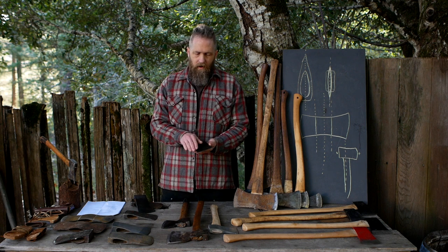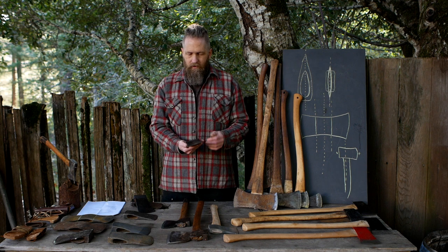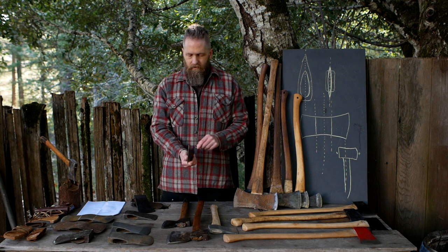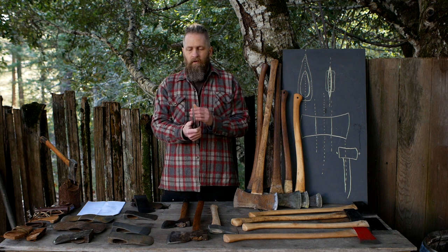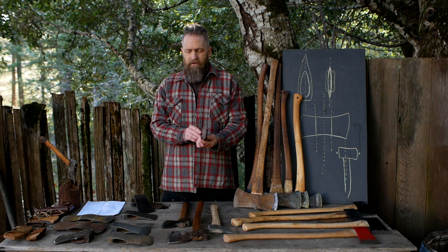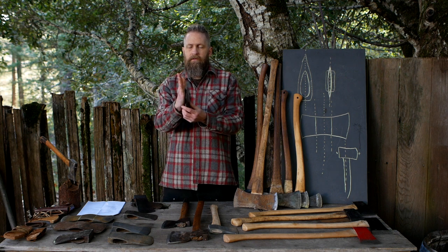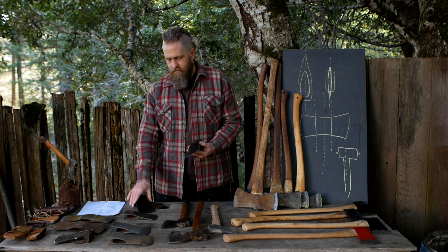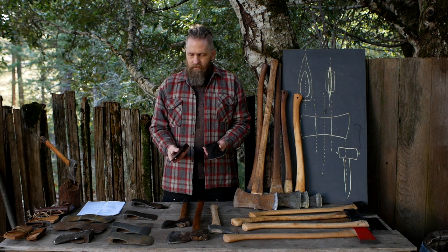It's deeply pitted. It has coarse grinding marks that go all the way up to the edge. The edge is wavy, indicating someone ground it hard and didn't really know what they were doing. The eye walls are not the same thickness — this side is considerably thinner, which means it's either going to mount crooked or you'll have to compensate. The bit is not very symmetrical — everything's fine up to a point and then the entire bit goes off to the side. There's no fixing that. This other axe has no name — it just says Made in USA — and it's beautiful.